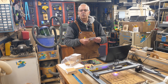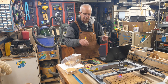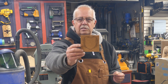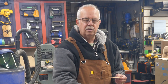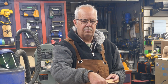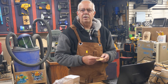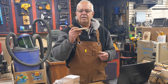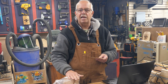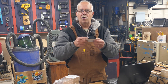One thing you could do is put some double-sided tape on the back, but I'm engraving pretty much right out to the edges. When the laser gets near the edge it blows the coaster over. I have a template I've made for four-square projects, which I put on top of my spoil board. Getting these to stay down is tricky because they're not perfectly flat as they come from the factory — they have a little bit of a curl to them.